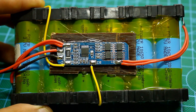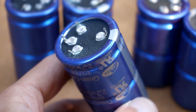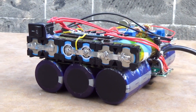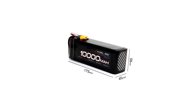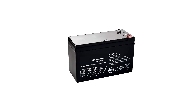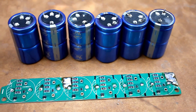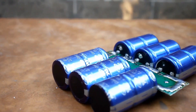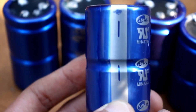Before examining each part of the circuit in detail, I'll answer the question: why use capacitors? Can't we just use a regular battery? You can, but you need a battery that can briefly deliver currents of 300 to 500A or more — for example, model polymer batteries, or a pair of batteries from an uninterruptible power supply, or a car battery. But in any case, the key feature of capacitors is their very low internal resistance. Therefore, they can deliver huge currents, and that's normal for them. And the lifespan of capacitors is very, very long, unlike any batteries.